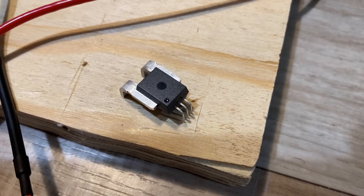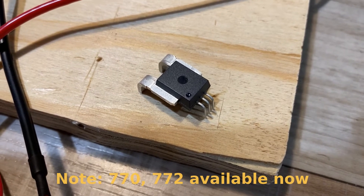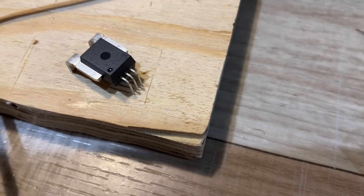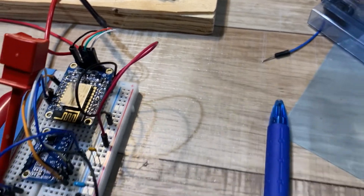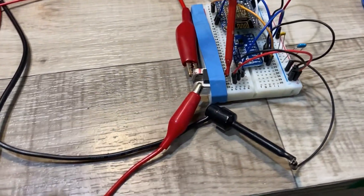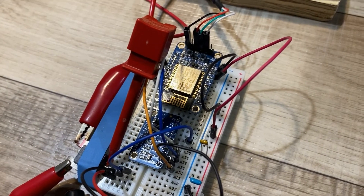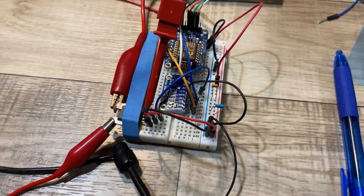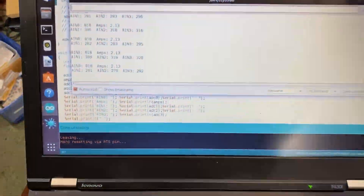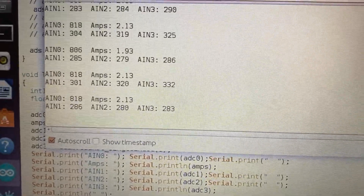I'm pretty excited about this new solution. So here is that new device. Like I mentioned in the intro, it has two Whopper pins on the left. The current passes in one and back out the other, and then three smaller pins for power, ground, and signal out on that side. I have it in this little test setup just to make sure everything works before I put too much effort into it. You can kind of see it peeking out over there. All I have here is that ESP8266, like I have in the main project, and then the same A-to-D board connected together via I²C.